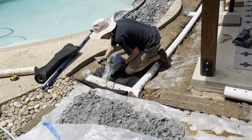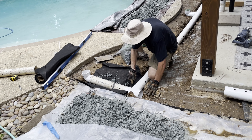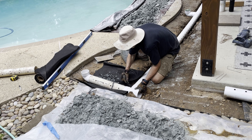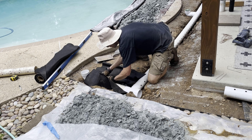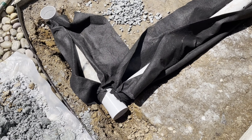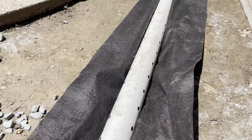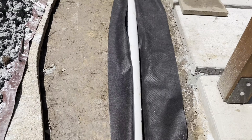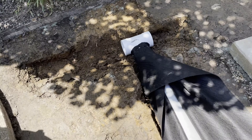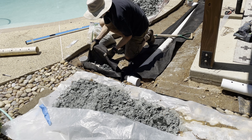I'm doing the whole French drain with fabric, going over the elbow joint and the T joint. Just making sure it's all level exactly how I want it, and checking that the drain is not above the final level — it should be just about level, actually a little bit lower so water funnels into it. Now I've got it all set up and I'm putting the stone aggregate around the edge. I made a mistake here — it's easier to zip tie at the joints first. I use two-foot zip ties to hold the fabric in place, then put it in. You don't need to aggregate around the joints anyway, so this just makes it a lot easier.